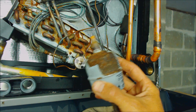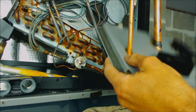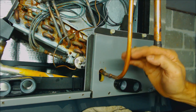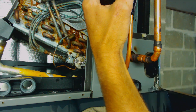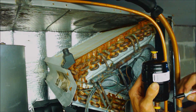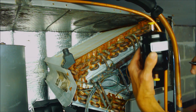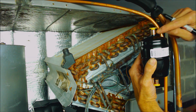When we do mount these on the outside of the building, it's just a potential leak spot that we want to avoid. Next we're going to bring this cover plate back down again before marking out the filter dryer. We don't want to forget about it, and we also have to have the filter dryer up high enough so that this can always come back out and swing up if we need to get into that area. I'm going to make my bottom cut first. I can't just mark it here and here because this right up here isn't flush against my other line set and I want it to be nice and tight. This is a little short and we're going to make it up with the distance on the filter dryer. I'm going to cut right about here, and after I cut that I'll see if this will fit right into the end here.